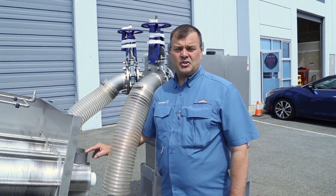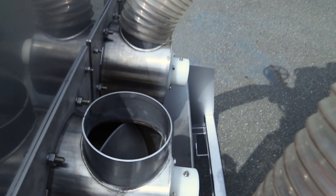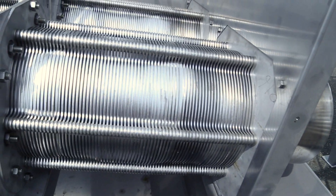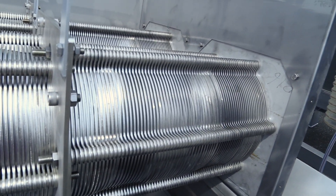The auger of the Trident Processes MD press is just slightly larger than the holes in the rings that it passes through, which causes the eccentric movement, moving each of the plates in and out of the material very gently, applying pressure as it moves through the screw.